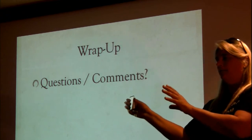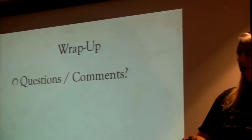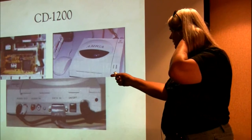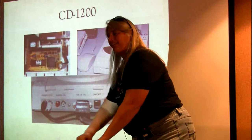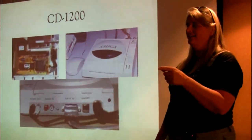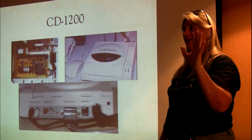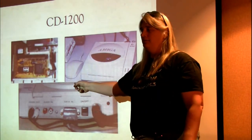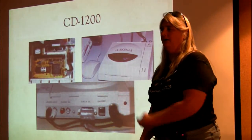pre-1992, the proof of concept products, the future thoughts for how to expand things, where we could go if we had more time. Oh yeah, the one thing I forgot to mention was the full motion video aspect of this: underneath the card here was another one of these kinds of connectors. And if you had a CL480 that could do audio and video and synchronize them, had the ROM, all that stuff together in one small package, you could have put together a full genlockable MPEG stream and stuck it on the bottom of the card on the inside of this box.